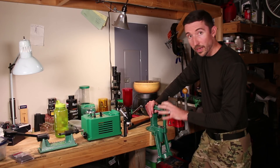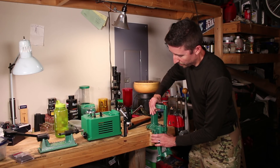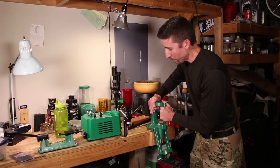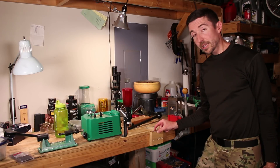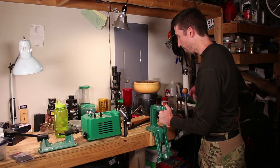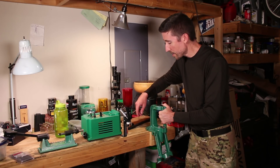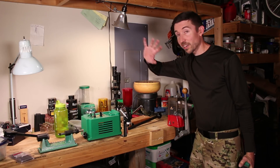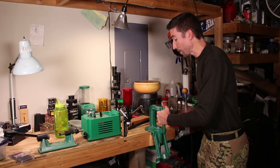This is going to have a lot of torque on it when I actually do some of these operations, and I want this housing for the piston to be up against something so I'm not just torquing on these bolts and yanking it out of the bench. So what I've done is I made a measurement to figure out exactly where the halfway point was on the studs down here, and then I stacked up one inch of plywood right here — I just attached it to the side of the bench. Now I can drill straight through that stud, go straight through the top of the bench, and attach a very long bolt underneath. I think that's going to work out great. Please leave a comment if you think of a better way to get this attached — I'll put it at the top.